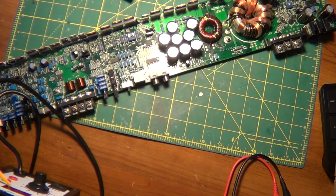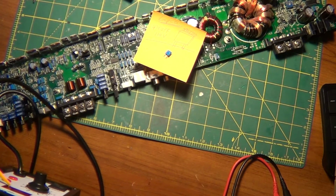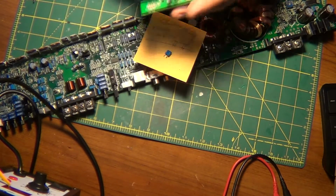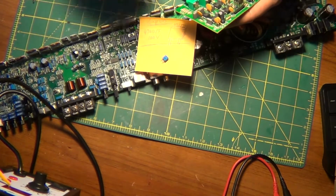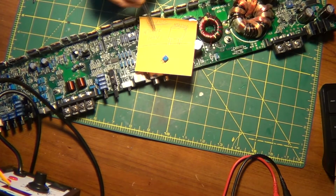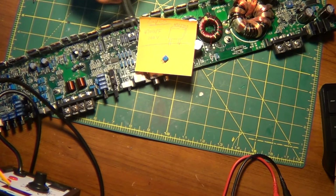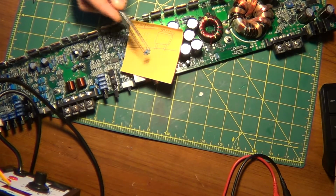Alright, so unfortunately, I don't have a capacitor. Well, here's what I came up with. Where the hell is it? I don't even know where the paper is. This little blown capacitor. Here's the values for it. Now, unfortunately, I don't have anything new, and I really don't want to wait around. But I do have spare parts. But the thing is, I don't have this exact value. But I checked the chart, and I can add the 2 of these, and it will equal out to that 4700 pF at 100 volts, and therefore can replace that one there.